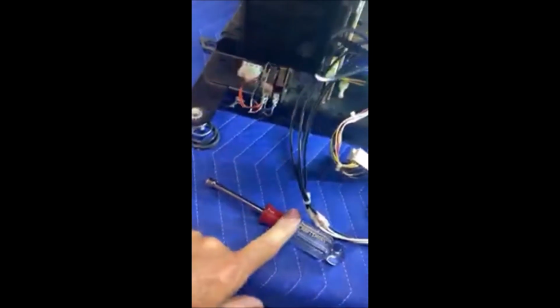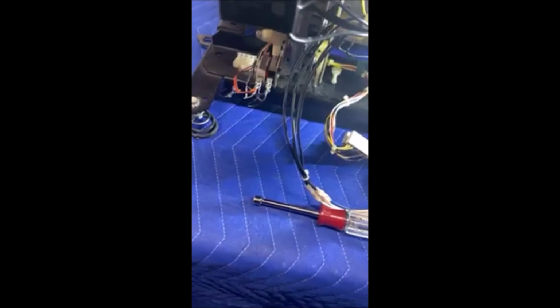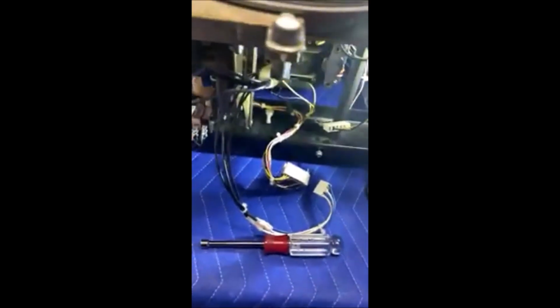Sprague motor's all reinstalled with the new Sprague gear. A little pointer, because it'd make it a lot easier. Get yourself a 1/4-inch nut driver, but get one that's probably 12 inches long or so. This little 6-inch one makes it kind of hard. Had to work at it.